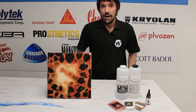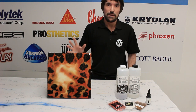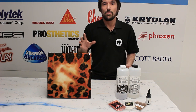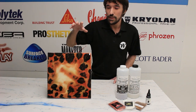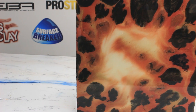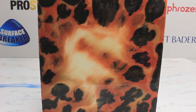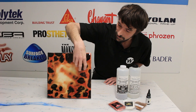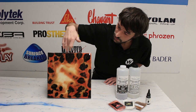Here's our finished lava board. I had an idea in my head about how this might look when we started and it's really come out exactly as I imagined. We always like to tweak and change the way that we use the epoxy just to see what different effects we can get. In the case of this one, using that darker epoxy when it was a lot thicker — when it really started to set — has given a really good contrast between the nice blends in the pearlescent yellow and the red, into these really defined cold areas where you have a much stronger edge to it.